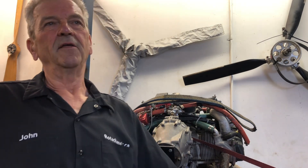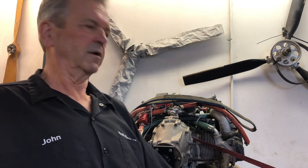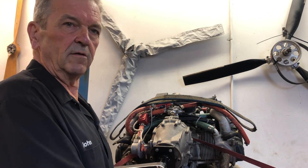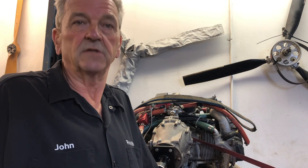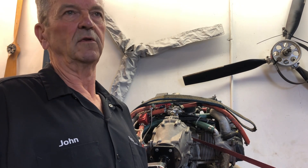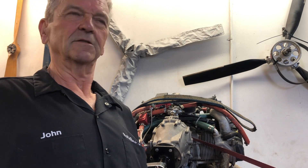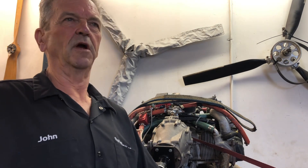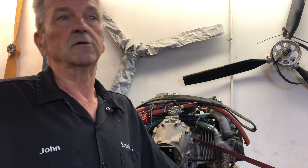The investigation begins. There is a test in the maintenance manual called 'Performance for Smooth Operation' that gives a specific maximum torque it would take to rotate the propeller flange through the gearbox and crankshaft, to find out why this engine is so tight it won't turn over — because it's not the starter. It says in there 110 to 111 foot-pounds. That's like wheel torque on a car. I really couldn't understand that that was potentially a good number. If it was that tight I would think it would be totally seized. I inquired to find out if that was a misprint in the book, and apparently it's valid — I don't understand.